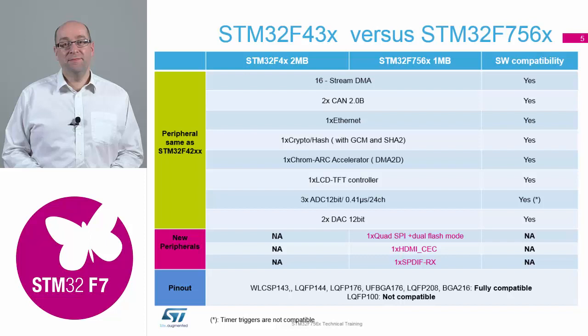All your software is 100% compatible with what we've got there. For the ADCs, we've not changed any of the way they work — we've just changed which timer trigger channels are allocated to each of the ADC peripherals. So you've got three ADC cells inside there, and the timer triggers connected to each of those cells has changed slightly. You've still got them, but it might not be timer 1 channel 4 anymore — it might be timer 1 channel 3.